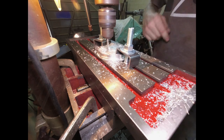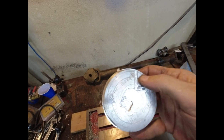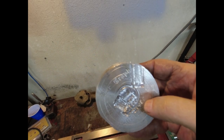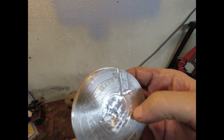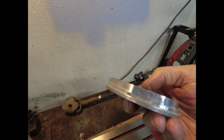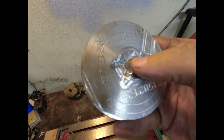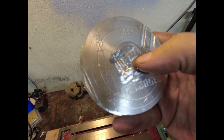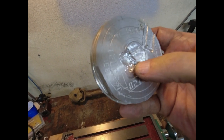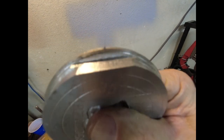Let's stop and take a look at all this. I took it off my drill press so I could show you the work. Here is the first little U-shaped cut — about a sixteenth of an inch deep — I thought that turned out really, really well. I'm shocked I didn't get more chatter than that doing it on a drill press. This is the trough I cut, probably about a quarter inch deep. The only reason it looks rough is because I was doing it by feel and not maintaining a nice smooth consistent edge. When I do it for real I'll have to set up stops.